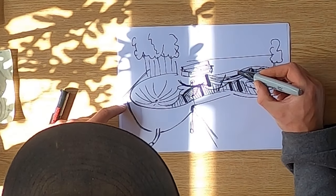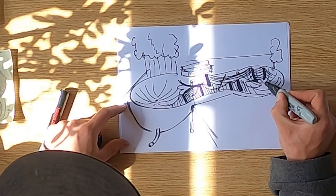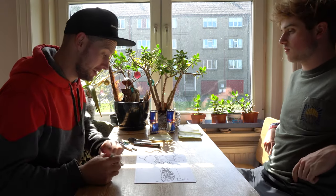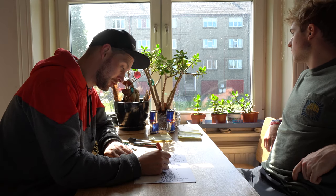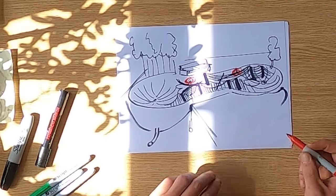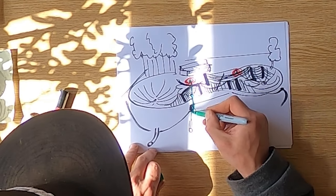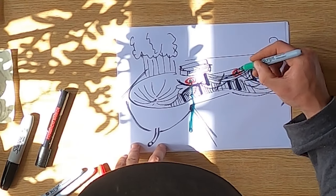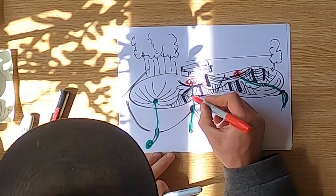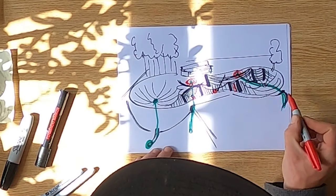The other problem point of this little underground drain here is going to be drained into that drain there. I'm going to get another colour to demonstrate. Colour-coded markers now, and I'm going to mark in the danger spots of the low point here and this drain here, and the green is going to indicate the drain hole and the route of the drains. We've got one from here, and that should cover us, because that's a low point here. We'll mark that there, a low point here, a little low point there.